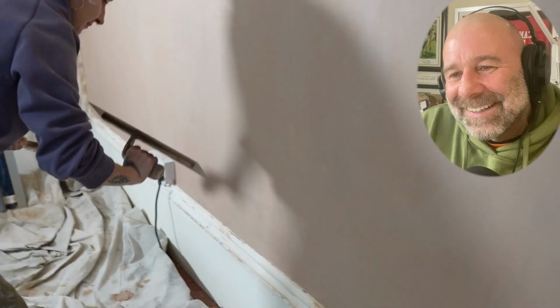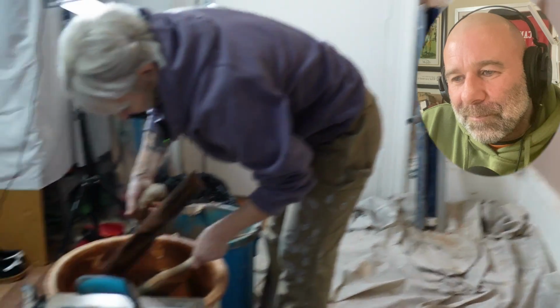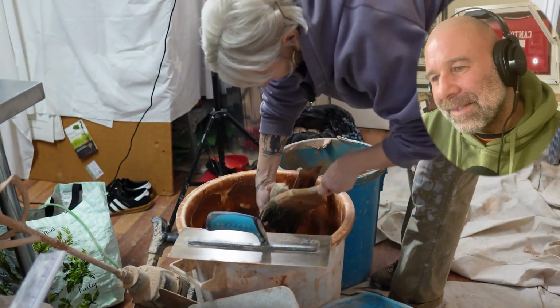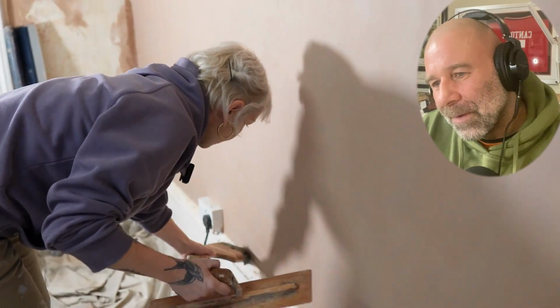So now the problem is we've got a bit of excess plaster on there. At the polishing stages, don't be scared to clean it in the water. Yeah, don't be scared to do that. Look at his drill. At this stage of plastering, the later stages, we want our trowel to be very clean, because we don't want to be putting any more plaster on. Our trowel wants to be clean at later stages. Why don't you try cleaning it in the early stages, for fuck's sake?